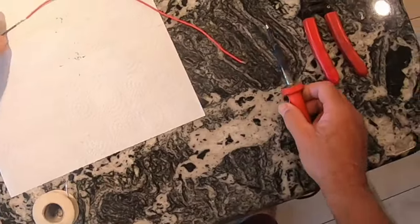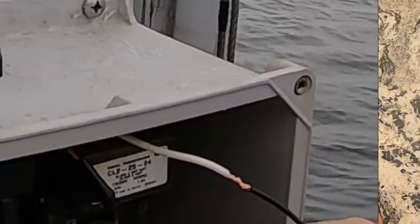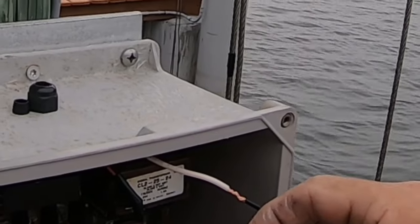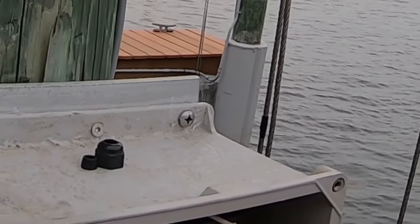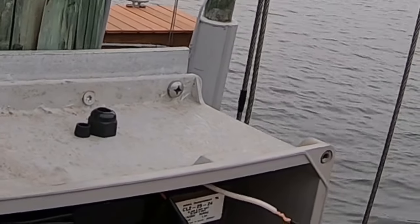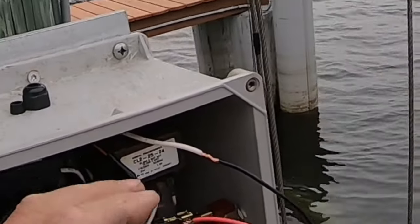So, all right, that's the end of the soldering lesson, but I wanted to make sure that I got that in. All right. You cross them like that. The one wire around the one wire, and you wrap the other wire around the other wire, and keep your little spikies the hell out of the way, and now you're ready to solder.